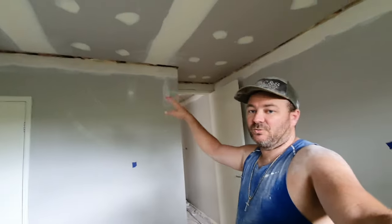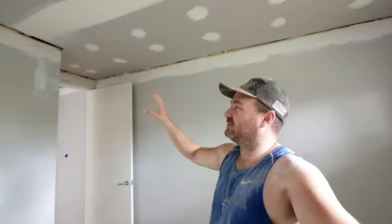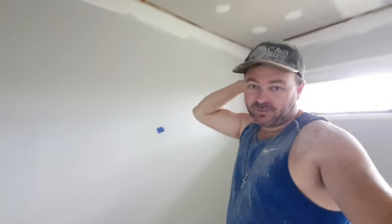We actually had to clean up that cornice edge — we made a big mess of it and had to go and skim it. So everything down this end is sanded, we've got all the cornice in. Once we do put the cornice up, I want to skim it with top coat, but once we put the cornice up we might dig in and it might not hold as strong. We'll put the cornice up and then get our three-inch blade and skim along and run it along the edge. Should be alright — we've got all the corners cut through in here.